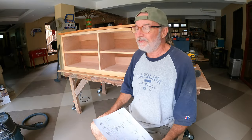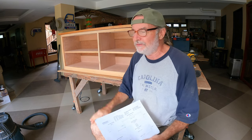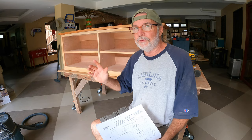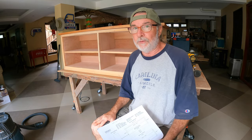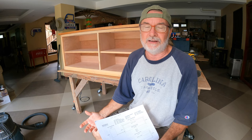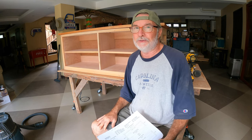Now that I'm in the process of finishing, I saw something I wanted to change. Sometimes what's on paper doesn't reflect what you want when you see how things actually fit — sometimes you make a mistake, but that's okay because we allowed for that. Using the shelf jig holes we already drilled inside, we actually have enough room to put another shelf on each side, giving us two shelves and a bottom shelf — basically three shelves for shoes total. We can add anywhere from four to six more pairs of shoes, so we're going to make that modification to the original plan.